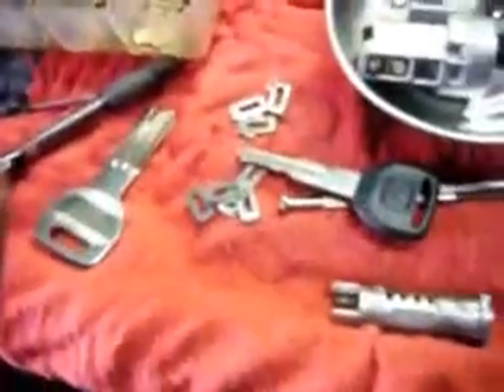A lot of you would probably say you'll go to the dealer and get a new lock. But they don't sell just the cylinder — they sell a whole lock assembly. And that's going to be a project trying to take the whole thing out of your car and put a new one in. Here's something you didn't think about: you're going to end up with two separate keys — one for the doors and one for the ignition. So just keep that in mind. I'm going to put new wafers in this one and rebuild this lock. It's going to be brand new.